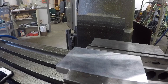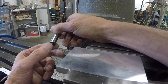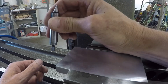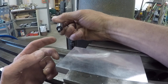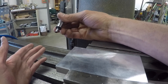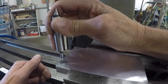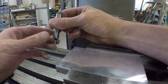What I'm going to show you first is the textbook way, which is with an edge finder. An edge finder has this tip on it that's spring-loaded and moves from side to side. If you knock this out of concentricity and bring it up to the edge, I'll show you right now. We need to know that this barrel — the tip — is two hundred thousandths in diameter. A very common size is two hundred thousandths, and most of the ones here at school are two hundred thousandths. When we get up to the edge, we take half that diameter, which is a hundred thousandths, and use that in conjunction with the digital readout.